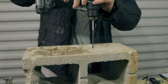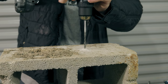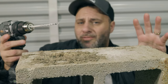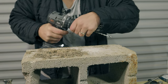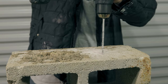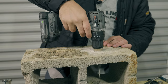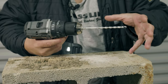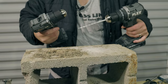Here's the regular drill going down through a cinder block or cement block. If you wanted to attach tap cons or a piece of wood to this, you'd have to drill a hole through — but you only have the one setting. It worked, it went down through the cinder block, but the cinder block is much softer than concrete. Now watch the difference when I switch over to the hammer drill mode — it's going to disable that clutch. Do you see the difference? Even though the hammer drill can do wood, metal, and plastic just like the regular drill, you can put special masonry bits on it and go down through cement and concrete much faster.